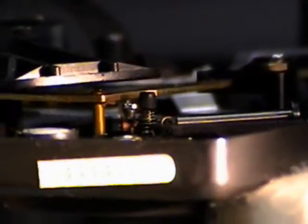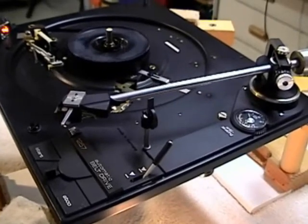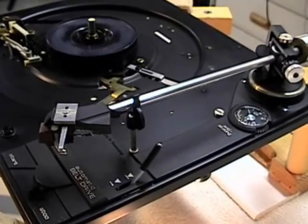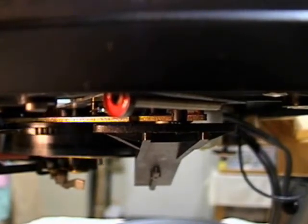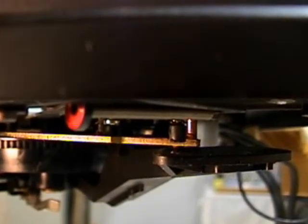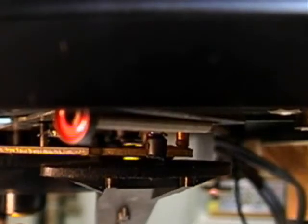And that's the Steuerpimpel pretty much in the middle of the picture, sitting right underneath the main lever. That would be the beginning of the record location right there, and now return back to rest. Going to hit the start switch. Tone arm is up, and at this moment the tone arm is now moving in, and it's stopped at the appropriate place, and now it's being gradually lowered, and now it would be on the record. And to return, tone arm is up, now it's over the cradle, and it is now on the cradle.